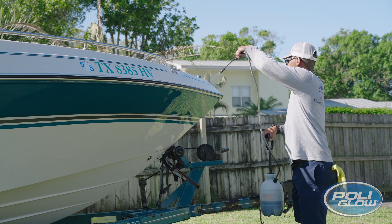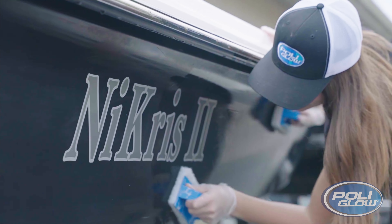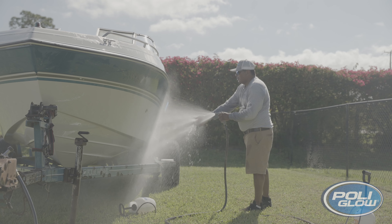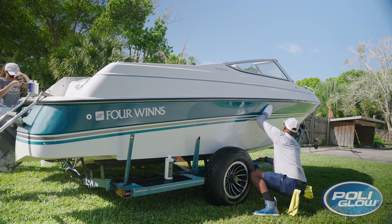How would I get Polyglow off if I need to remove it from my boat or RV? Thankfully, we have a product for that — it's called Polystrip, our highly concentrated formula for removing Polyglow. First, protect your hands with vinyl or plastic disposable gloves. Mix one part Polystrip liquid concentrate to three parts water in a trigger sprayer. Apply Polystrip to a four to five foot area, working in sections. Wet it down, spray Polystrip on, then scrub the section using the white scrub pad. You will feel resistance at first, but it will start to loosen up as the Polyglow releases due to the Polystrip. Rinse with clean water and repeat until all the Polyglow has been removed, back to the bare base fiberglass, so that you can reapply Polyglow.